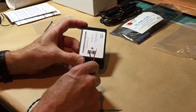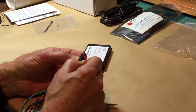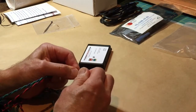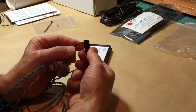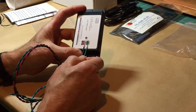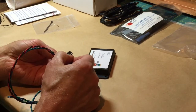Looking at the polarity on the wires is important. The black wire will go into the number one hole at the very end. It also often helps to twist the wire ends — it makes them easier to go in and keeps stray strands from getting in the way. They lock into place and you'll see that the insulation is also recessed. I'll do the same for the CAN bus wires: CAN high is green, CAN low is blue in our systems, and you'll insert those in the appropriate slots.